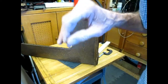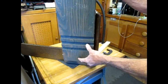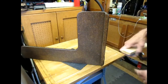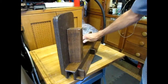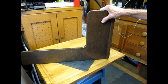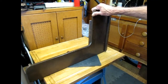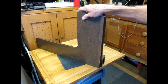Like I said, all I'm doing is recutting these ramps, so I didn't spend a whole lot of energy. It's all glued and stapled. Anyway, I threw a coat of stain on it and mopped some varnish on it. I'm a block from the beach, and particle board loves to soak up moisture, so this keeps the thing from swelling. For what I've got into this, nothing. Used up scraps, like I said.